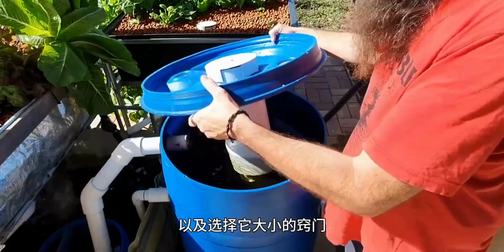And that pipe runs through to another sweeping bend that redirects the pipe vertically inside a stilling well, and it terminates towards the top of the filter, and you may actually be able to see a few small bits of solid come through there. Now this stilling well has a larger volume of water in it, so the entering water slows down in velocity slightly, and it is then redirected downwards towards the base of the stilling well. There, that water with the solids in it is introduced into a larger volume of water, so the velocity slows further again, and the majority of the solids will then precipitate out of the water column and settle on the base of the vessel there.